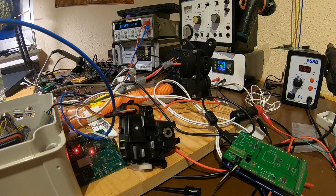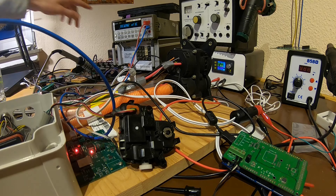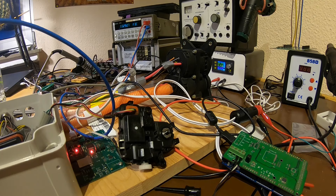In the foreground you see the connector lock, in the background you see the state C signal, which should jump to over 3V when we start charging. You can see the connector is locked now, and we have state C turned on. Now I'll cancel the EVSE, and after some timeout it should all be reverted.